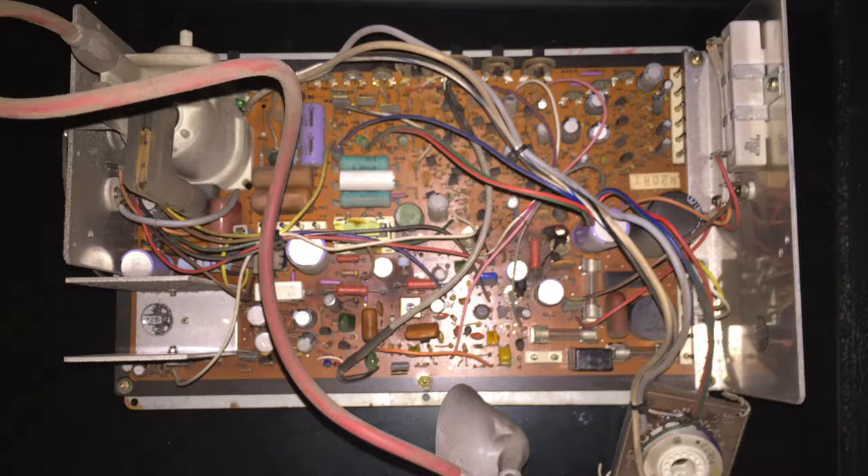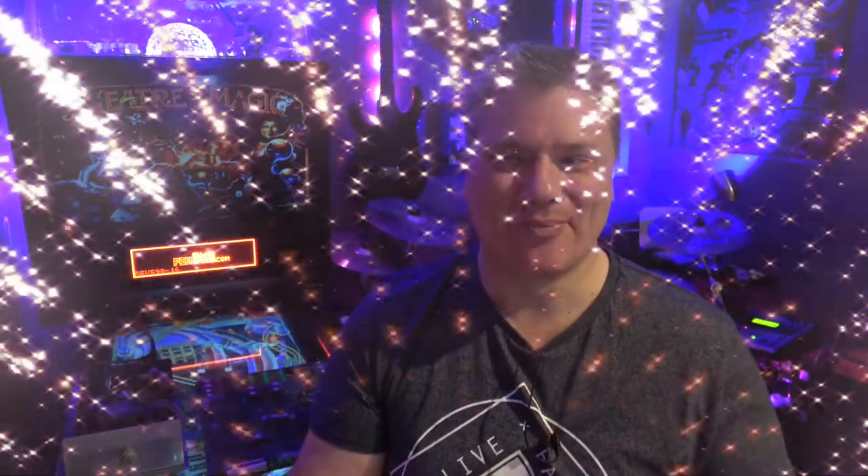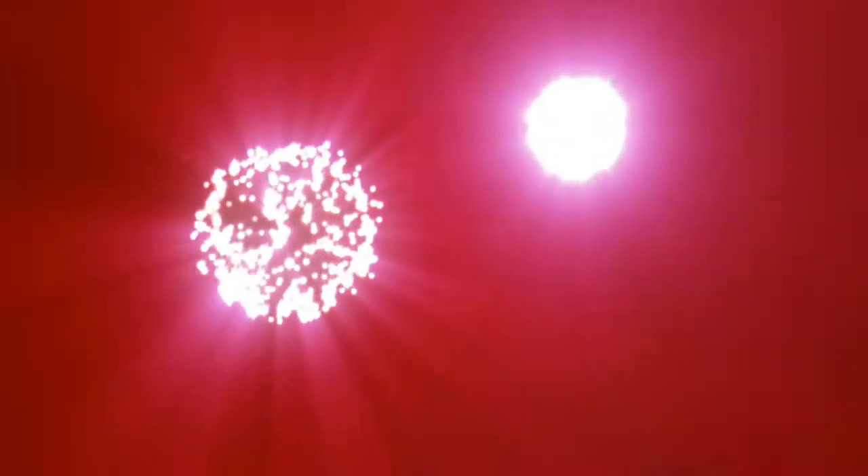So I took the chassis out and immediately noticed a few things. When I took that monitor out, I did the grounding method - wow, that gave a massive crack. A lot of the older monitors just don't dissipate their energy automatically. You should always do the check anyway, but it took me a little bit by surprise. I got a first big crack and pulled the screwdriver back, and then when I put the screwdriver in again, I got a secondary crack. So it just goes to show you really want to do it a few times to make sure the electricity is out of there.